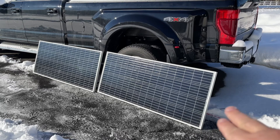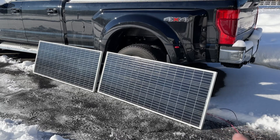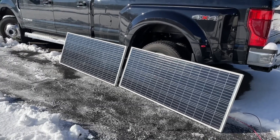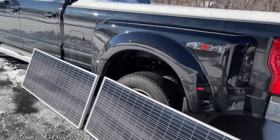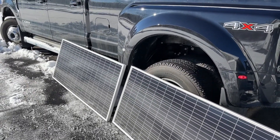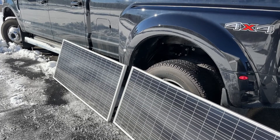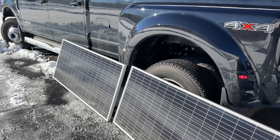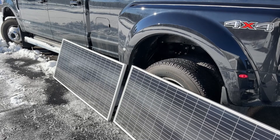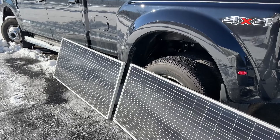You can see my two wires coming in going into the solar charge controller in the basement. If you're new to hooking up solar, there are a couple of things to pay attention to. First, you've got to know if you're going to be hooking up in parallel or series. Since I'm in series, I don't need any special adapters. But if you're doing things in parallel, there are Y-cables they make so that you can hook the panels up in parallel.